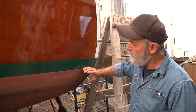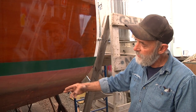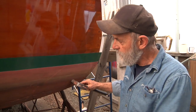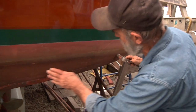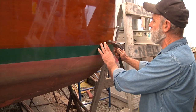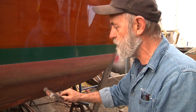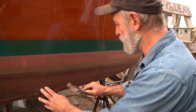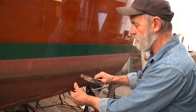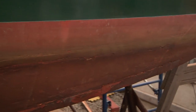When I get up inside, I'll be looking at the condition of the corner post in the transom — the entire framework, the vertical frames, and the frame at the bottom that catches the end of the plank. First I'd like to inspect this bottom plank a little bit. I can see it's got some checking in it, and I'm going to sound it with a hammer. When you bang on things that are really solid you get a crisp sound, and when you bang on things that are a little soft the sound gets duller. Tapping around, this plank is not solid against the framework behind it.